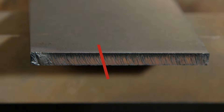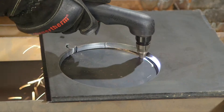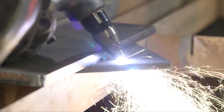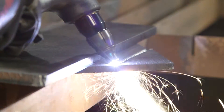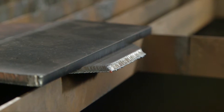Lag lines on the finished cut edge should also be about 15 to 30 degrees. A plasma cutting guide, straight edge, or template can be used to guide the torch. However, the distance from the shield's center to the edge must be factored in when creating a template or the placement of a straight edge. If beveling using an angle iron, plasma cutting guide, or freehand, remember that the material thickness increases proportionally with the bevel angle.